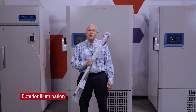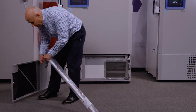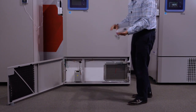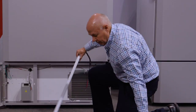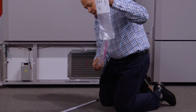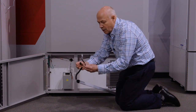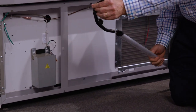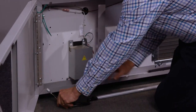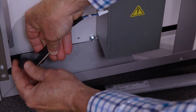Now I'm going to show you how to install our new light bar kit for the TSX ultra low temperature freezers. This is a new exciting option that provides a visual indication of alarm conditions on the new TSX units. First, I'm going to unlatch the lower door and use a little wedge to keep the door from coming back while I'm mounting the bar. I'll remove the light bar from the packaging. There's also a set of fasteners that I want to have out and ready. The first step is taking off the cap to ease the procedure of feeding the wire up through, then replacing the cap.